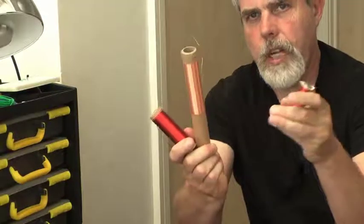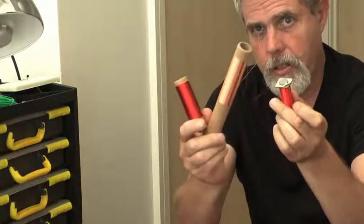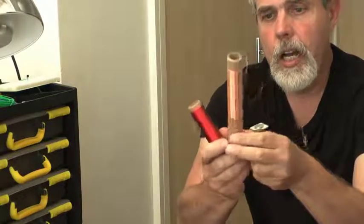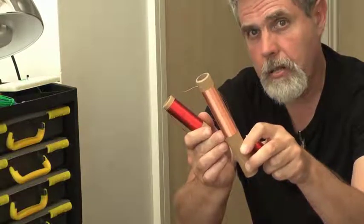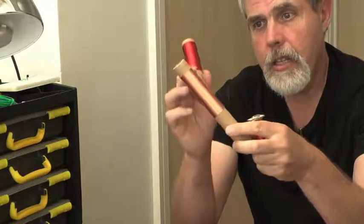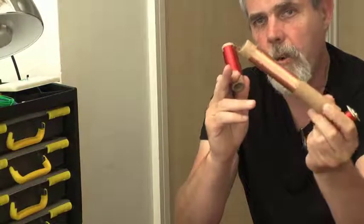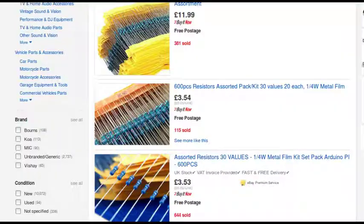Also good for adults and children, making coils and electromagnets and so on, or inductors as they generally get called. Then having some wire might be useful. Typically say 0.37mm diameter enameled copper wire. That's what I made this coil out of, on a cardboard tube that's normally used for making fireworks in. They're very tough and great for putting coils on.